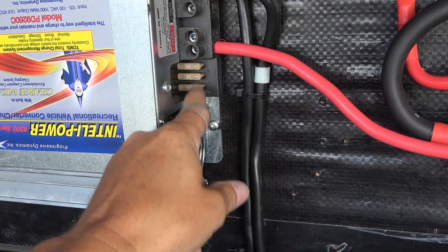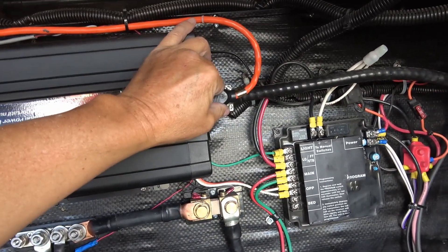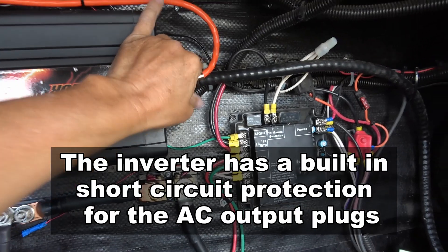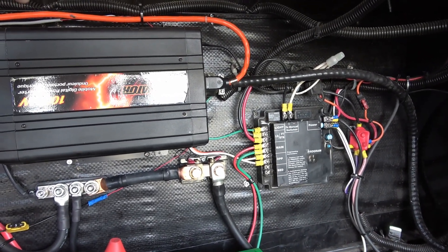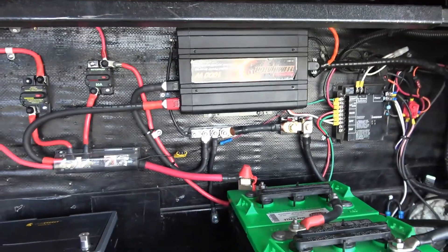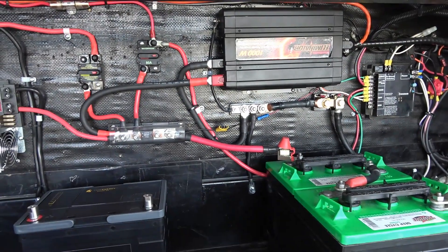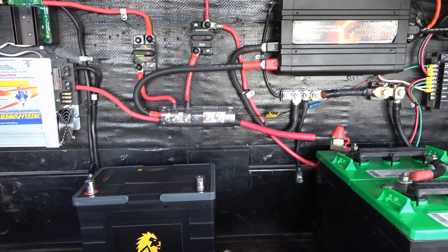The inverter output — I have two extension cords going into the RV and into some outlets. I don't wire my inverter into my regular RV AC circuits; it's all what they call a floating arrangement. I'll leave a link in the description to everything I've done in here if you want to check it out. I may upgrade from this once I get the new batteries — I'll have a lot more power to spare, so I may go to a 2,000-watt inverter. Anyway, I just thought I'd update you on the wiring since I get lots of questions about what's in there when I install batteries. Till next time — Ray from loveyourrv.com, thanks for watching folks, cheers!